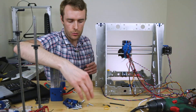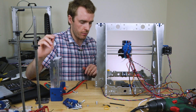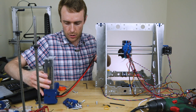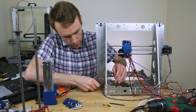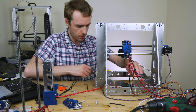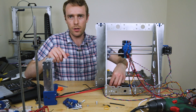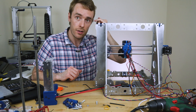Those bits that go opposite to hold the rods in are now finished — just finished a couple of seconds ago. However the bed is now 85 degrees Celsius so I can't touch it for a bit, and it's PETG printed on PEI, so it's going to be very difficult to take off until it cools down. Might as well get on with something else — I'm going to put the power supply back onto the frame and start routing a couple of cables. Once that's together, we'll get the bed on, finish the cable management, get cables to the right length, do the crimping and ends, and then I think we're good to go.